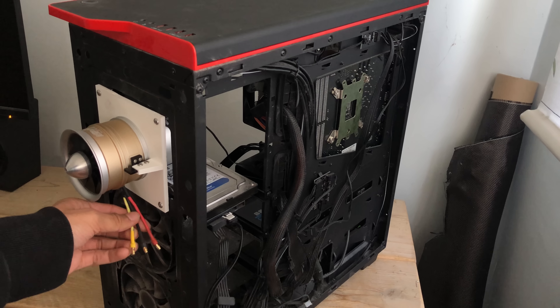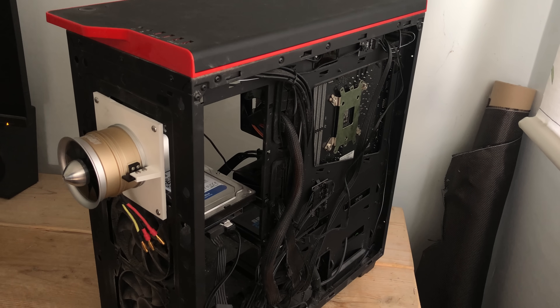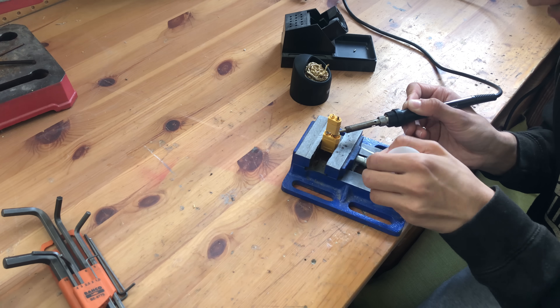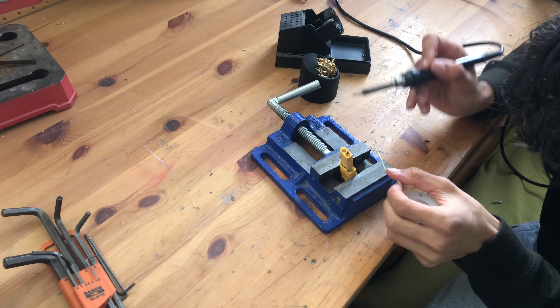It was also at this moment I realised that the connectors for the fan were small, and the connectors on the electric speed controller, or ESC, I was stealing from my RC boat were much larger. The different-sized bullet connectors was an easy fix. I also realised that the connector on my battery was too small for the massive XT90 on the boat ESC, so I went and did a bit more soldering. With that, I think we're ready for the first test.